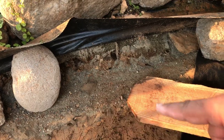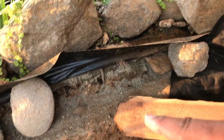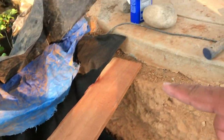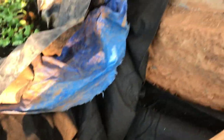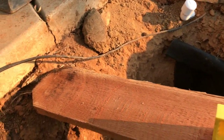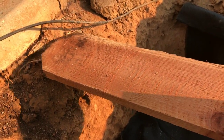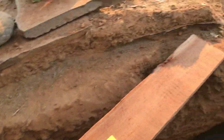What you do is get yourself a board — something like this. Put your board from this ledge here to this ledge over here, see how the board runs across? Grab yourself a level like this and you just level it out. That way you know your edge on this side of the pond will be even with that side. Use longer pieces, shorter pieces — put it on this side to find out if this ledge matches that ledge.